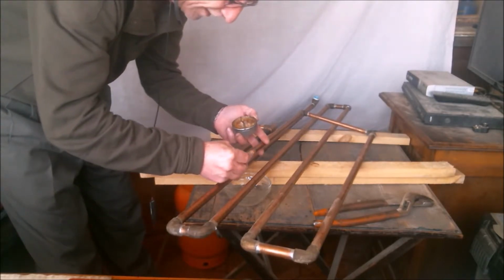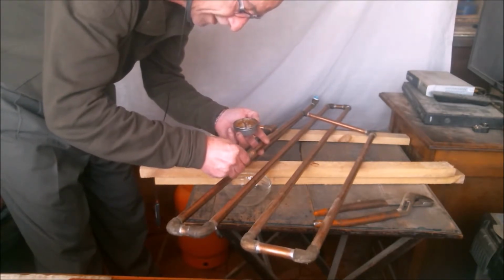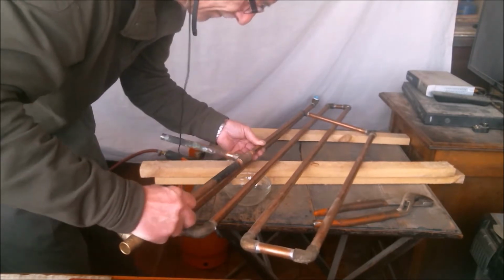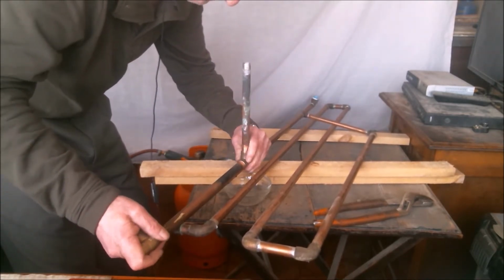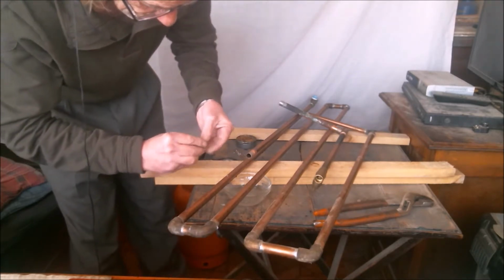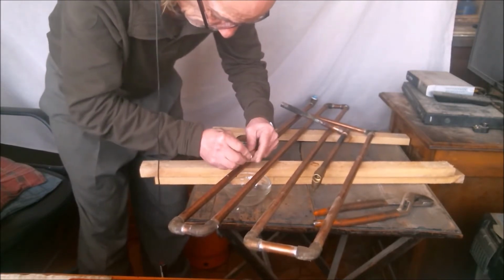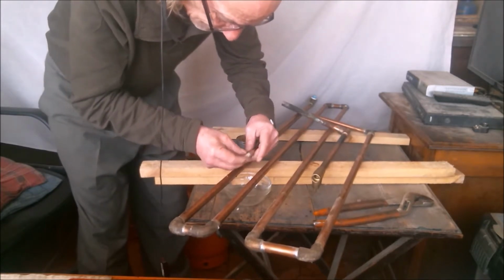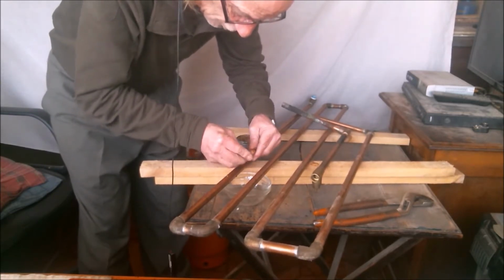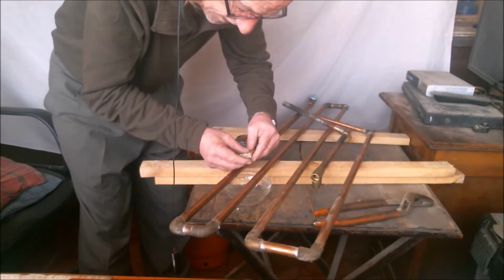We apply flux at will, covering the pipe well. And we join the pieces we will solder. Everything fits well, so now is the moment to push our dough into the pipe. A good amount, creating a strong plug not easily displaced or bypassed by the water which is starting to come in, drop by drop. Without force, but as soon as the pipe fills up, it will start building pressure and disintegrating the dough, the bread.